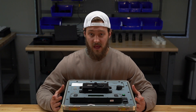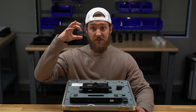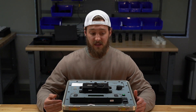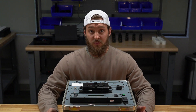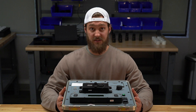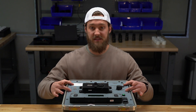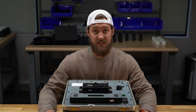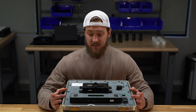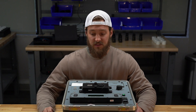On the systems side, this does everything from setting correct diopter — which is setting the prescription of the ocular lens to true zero diopter so you can then turn it to the prescription of your eye — setting infinity focus, collimation for goggles, and testing all different types of system resolution and spot spec. Everything from tubes to systems are tested multiple times, and what gives us the ability to do that is having an objective standard within the test set. There are multiple different reticles in this system used for different tasks: testing spot spec, system resolution, setting infinity focus, and setting diopter.